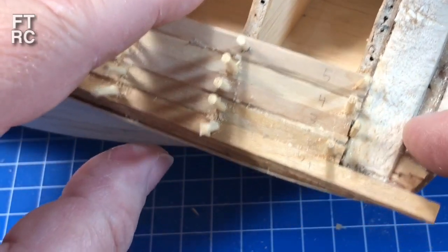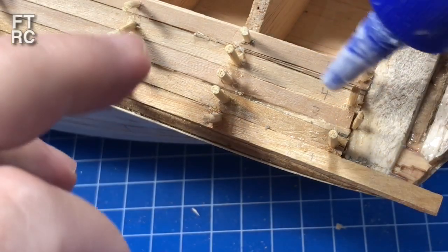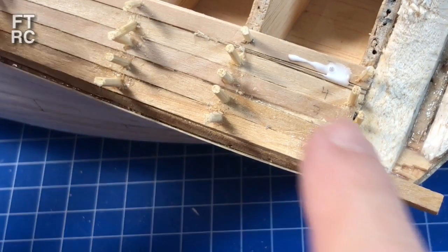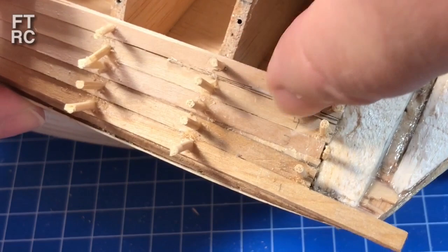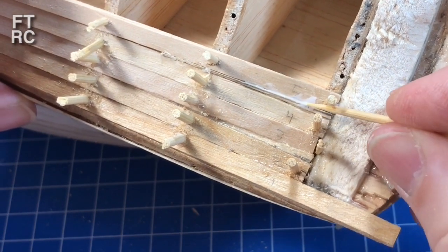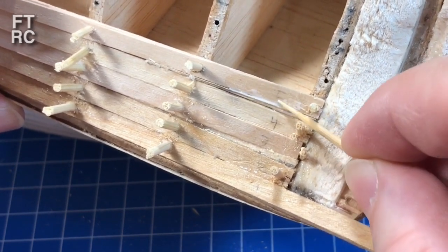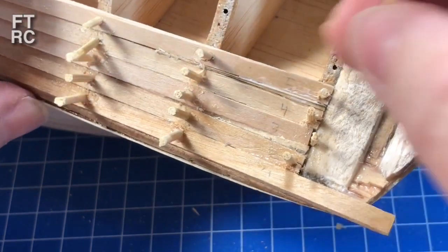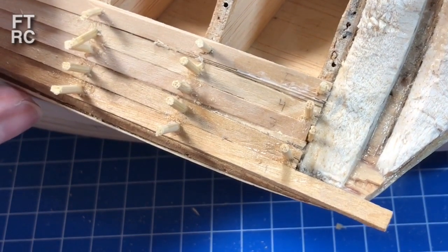There's a bit of gluing from before from putting in plank five. Generally what I do with my wedges is push the glue in from the top — works for me. Just basically work it in; you can work it into the curves using a toothpick and actually pull that glue into the space. I actually trial-fitted it before I shot the video and it was a bugger to get out, so I know it's not going anywhere. With a little bit of glue in there, that is set in place.